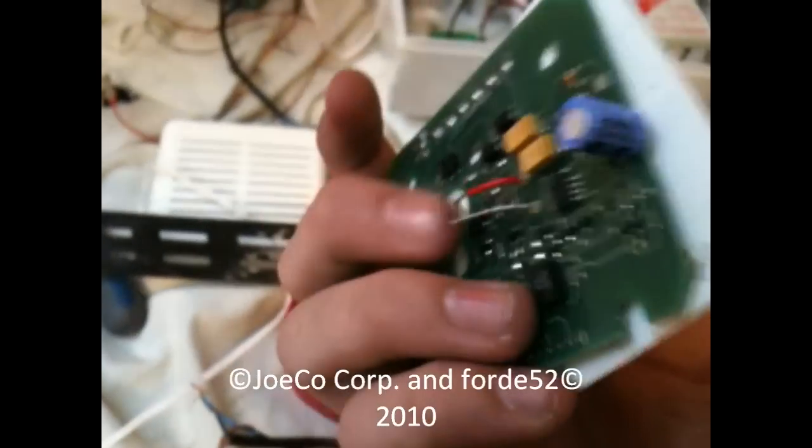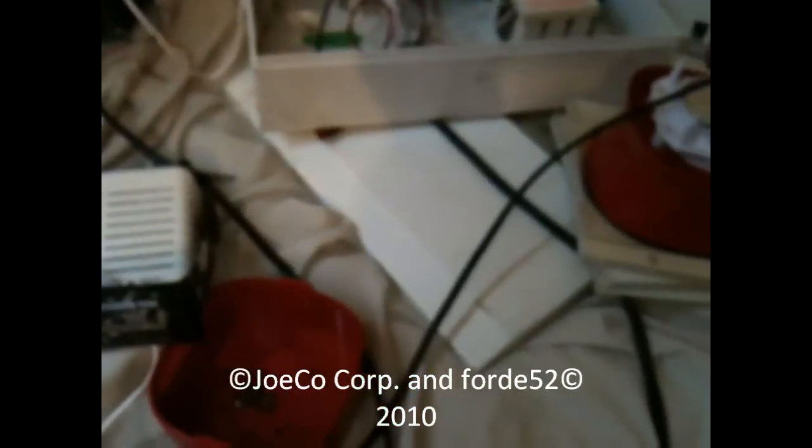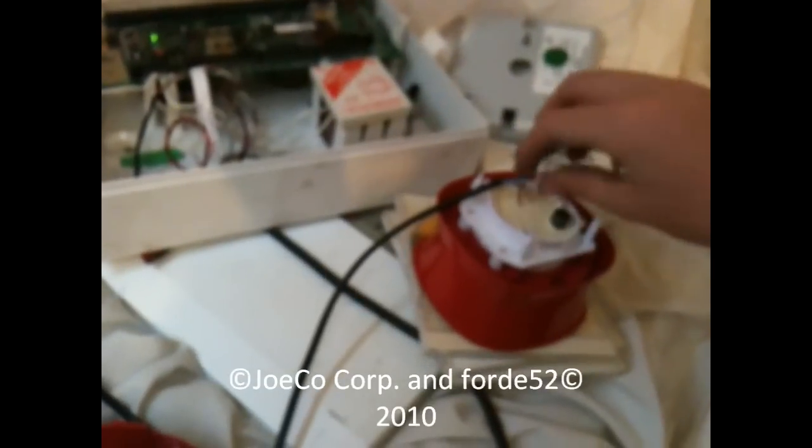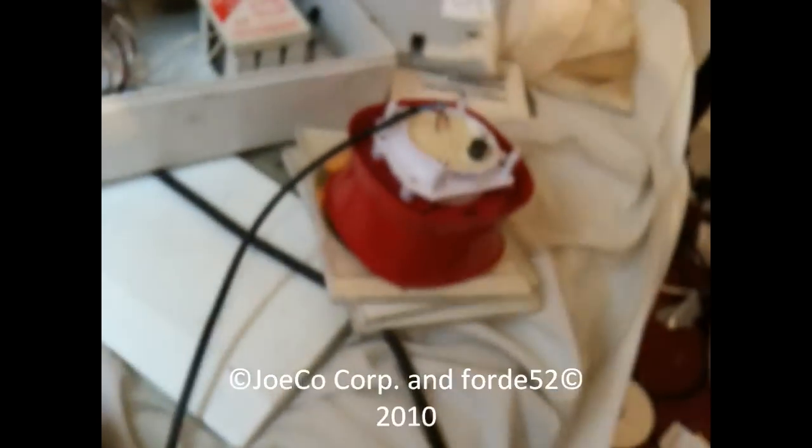I don't care, I like alternating. So that is one way to get yourself out of a problem if you accidentally buy an addressable product. Nine times out of ten it will be like this one — just snip those two wires off if it's got them, and apply power to it. I recommend about twelve volts to start off with; don't go straight to twenty-four volts, and definitely don't put two hundred and forty volts in because it will just go bang.